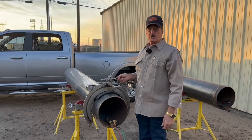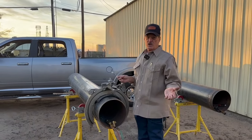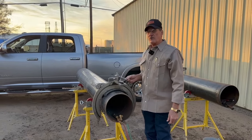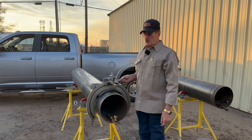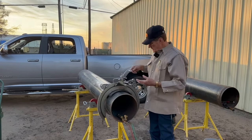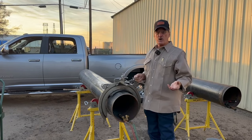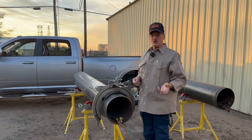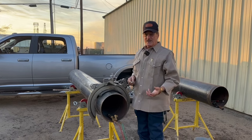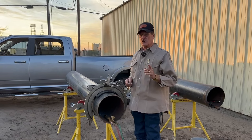When I bought this one, probably 10 to 12 years ago, it was about $2,100. I think right now it's about $3,000. So when you have these bevel machines and tools, you want to take care of them. If you drop them out of a pipe rack, you can warp it. I had a 2-to-4 that I bought 40 years ago and it still cut perfect, but about five years ago a helper dropped it out of a pipe rack and it didn't cut square anymore — I had to buy another one. I still have my 6-to-8 from 40 years ago and it still cuts perfectly.